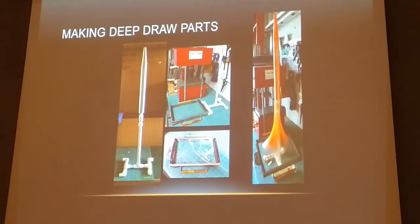Pat's got a model built out of it, so that's one booster that's built out of that material. There are some considerations — it's not as strong as fiberglass, so you have to kind of use it as a skin. But you can do a lot of good things with it and it has great surface finish. One of the big issues we saw in the first one is that painting had to be addressed.